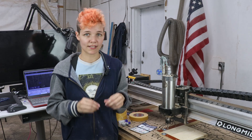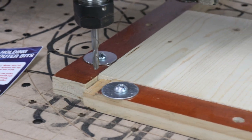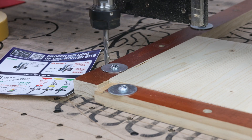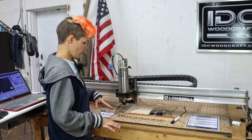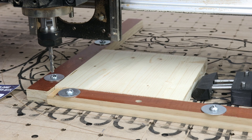I went the right direction! When I did the test run I kind of guessed on the X and Y with my finger and put the Z way up, so it wouldn't run into the material — I could just see how it ran without any hiccups. So now we have to reset the X, Y, and Z to our bit. I'll look down the line, make sure that's centered, and then for the Z I'm going to use the good old paper method. We're going to check and make sure the X and Y zero took — everything looks good. I'm going to inch myself down to the Z, make sure it looks good, and it looks beautiful. I've gone back through and done my for-sure checks for this carve. We've got the router bit in, XYZ zeros all set.